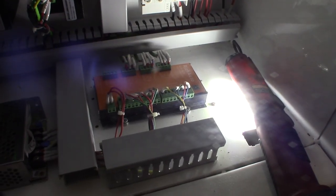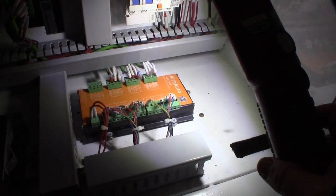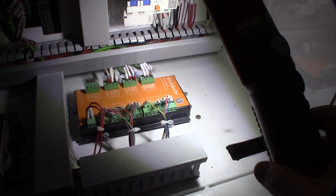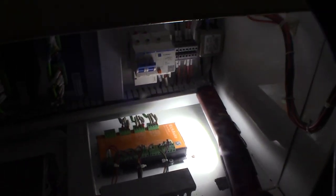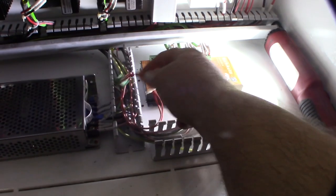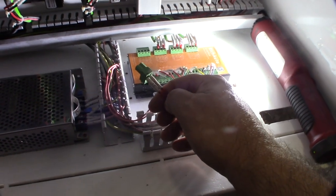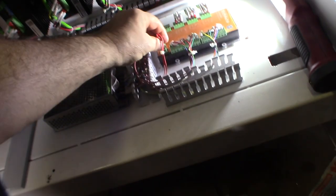My first experience with the Rich Auto — I noticed there's a shield pin, so if you have shielded wire you could take the braided part and run it into the shield to create a ground shielding effect around the cable. I wish they would have used a black wire for the ground — even though it's labeled 24-volt and zero-volt, there should be a minus sign next to it and it should be a black wire.